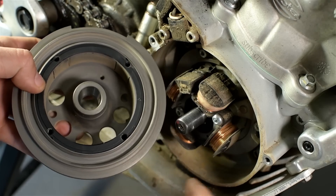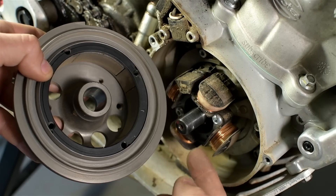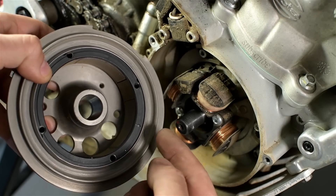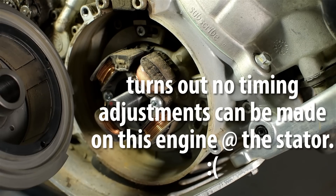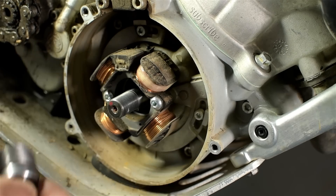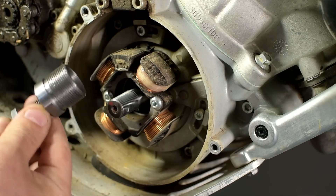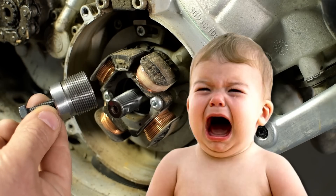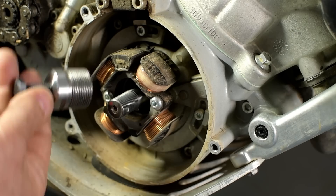When these things are installed and that large nut is torqued down, these tapers lock on pretty hard. For smaller engines, you can usually get away with a pry bar or two behind the flywheel and a soft mallet on the crank. Separating a flywheel like that is the equivalent of slapping your tooling against the side of your machine to get the tapers to come apart. I wanted to get in here to screw with the timing of this engine just a little bit. I hope you enjoyed following along building a simple tool. You can buy these for $10 or $15 or $20, but I wanted it right now. This puller also fits two or three other engines I have around, so I don't feel as bad wasting time to make one. Thanks for watchin'.